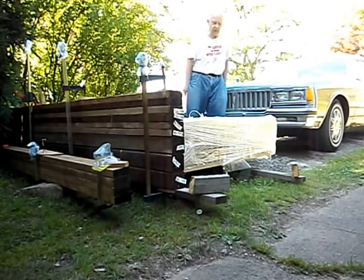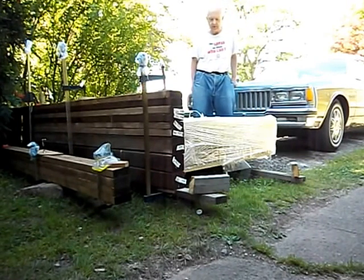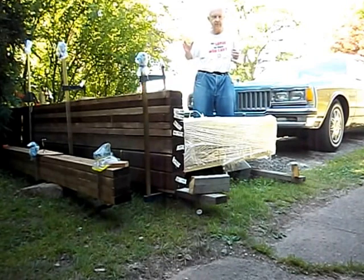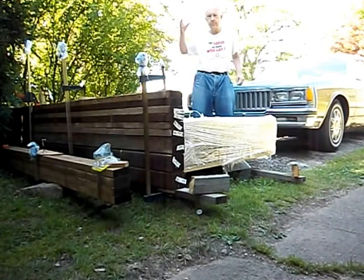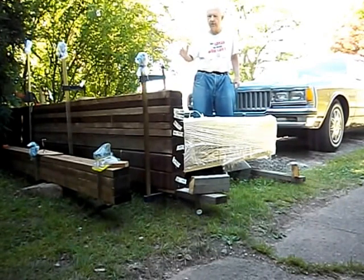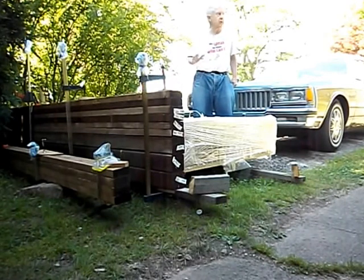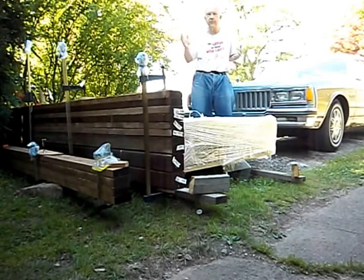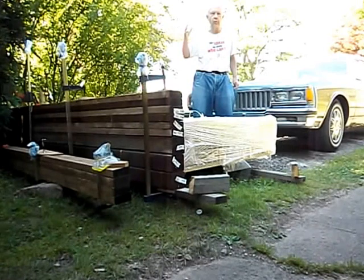Now I'll pick up the camera and show you what I did with the wood. Also, I should mention that the opening or slit of the dome will probably have a single or double door on the side of the cylinder that opens up. That will be the slit — the part of the opening that faces horizontally — and it will open up so that I can walk into the building through that door, as well as functioning as the opening for the telescope to look out of. For the opening in the top, I'll be using two wooden rails — four-by-four posts, ten feet long — that will act similar to a railroad track.